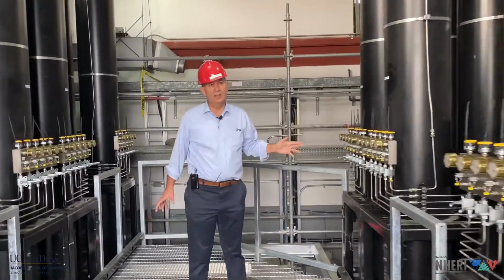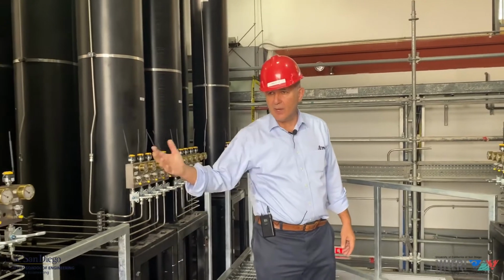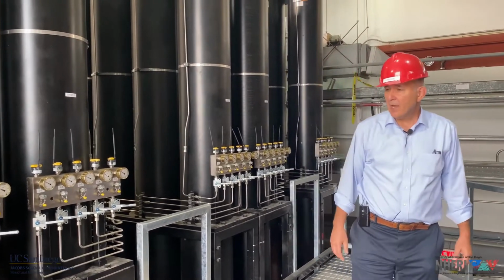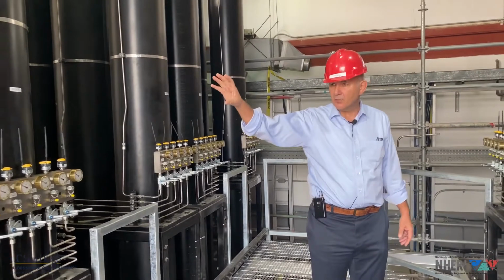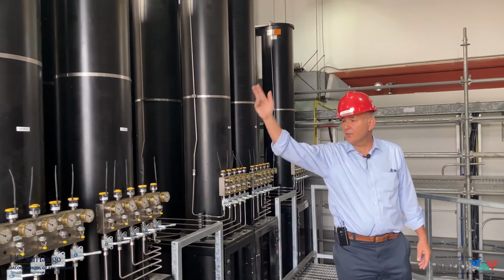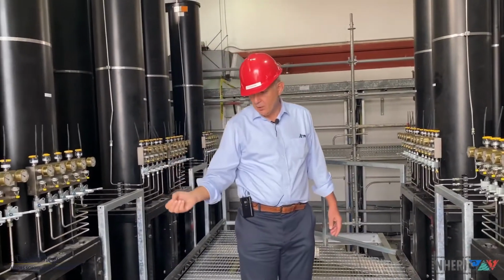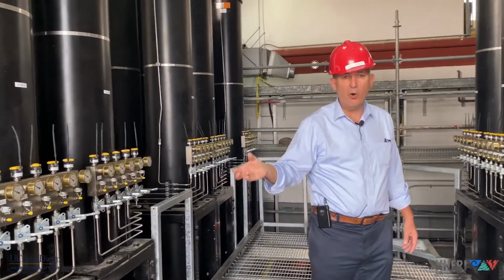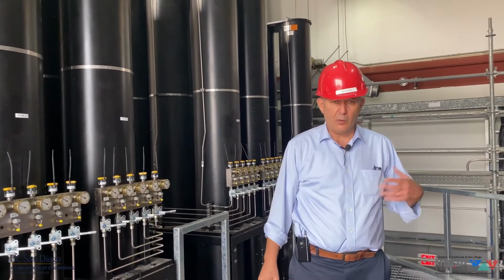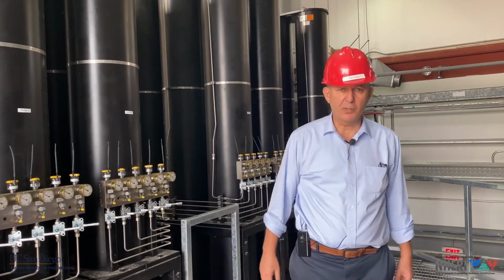These 2 pumps that you have seen are going to be used mainly to pressurize the accumulator bank, to push some oil at the base of each bottle, below the piston, until the nitrogen pressure, which is above the piston, reaches 5,000 psi. In idle conditions, the pressure of the nitrogen in the bottle is 3,000 psi. So about 20-25% of the bottom of each bottle will be filled by oil. And that pressurized oil is the one used to control the horizontal and vertical actuators when we reproduce a multi-dimensional earthquake ground motion.